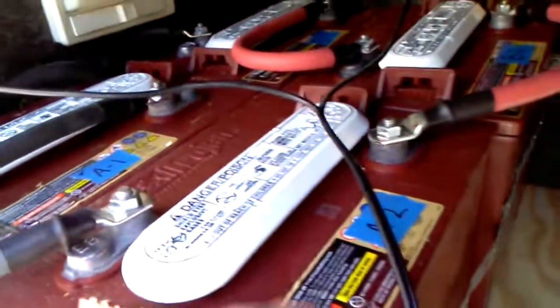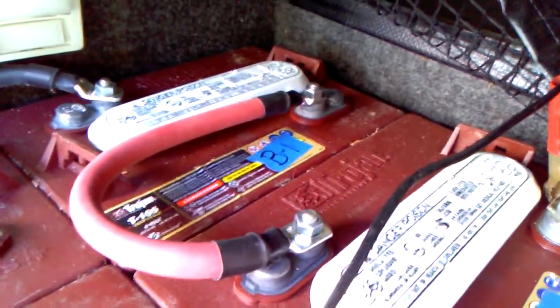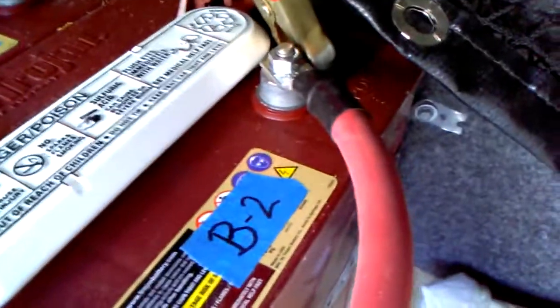This is my A battery bank — here's one, there's two. D1 and D2 put together. There's one positive — positive to positive — I know I've done this right. And there's negative, so I know I've got those right. That's negative to positive, making it a 12-volt bank.